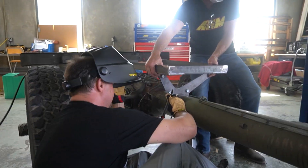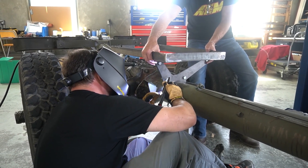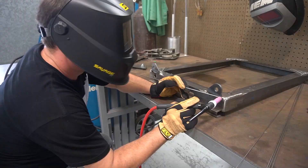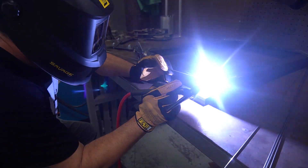Hi, I'm Mitch Terry from Protex Skid Plates. I've been working with AEM for many years as an engineer and fabricator, and worked on the race team for quite a while. Today our project is mounting the gen set. The guys at AEM have already mocked up the assembly and got everything in position. The first thing we do is measure it all up and make a drawing so we can get it into AutoCAD. Once we've done that, I'll cut the pieces on my CNC plasma and we'll bring them over here and weld it up.